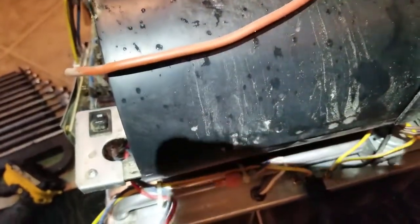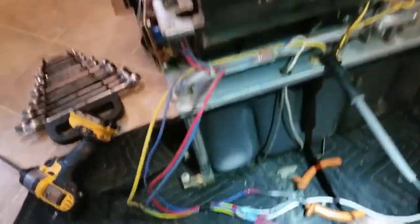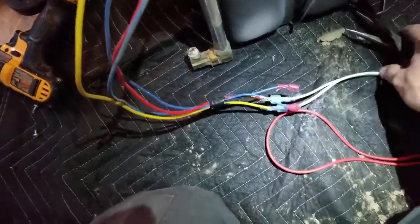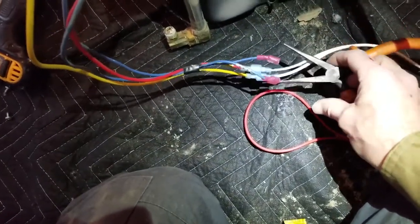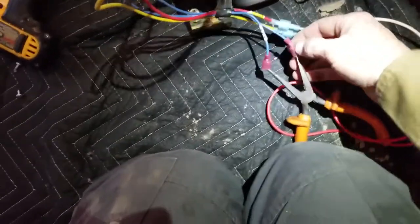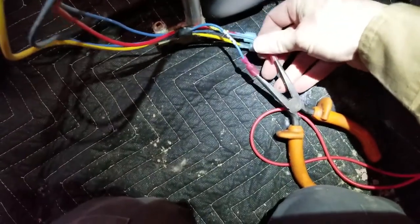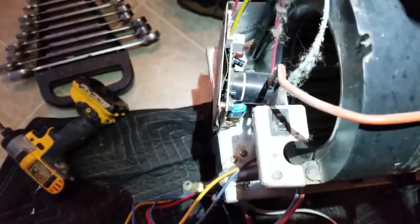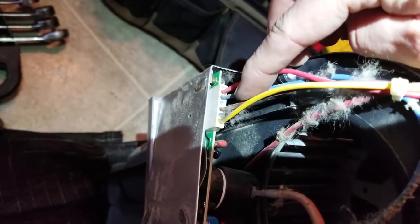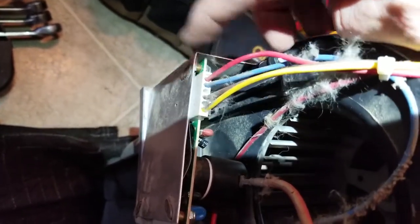I've already got it out of its enclosure. I've got a known good 12 volts, and when we connect these two blue wires together, it's simulating the thermostat. We're getting a clicking sound, and we follow the trail of 12 volts. You'll hear the click here on this relay board, the control board. The blue wire here has got 12 volts on it, so we know it's made it past its high-limit thermostat and its sail switch. So it's looking like this board is bad.